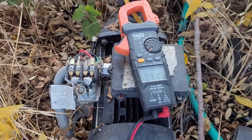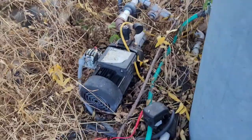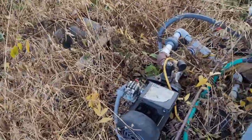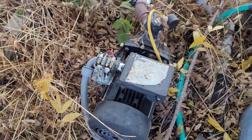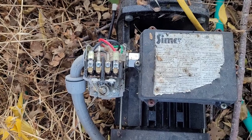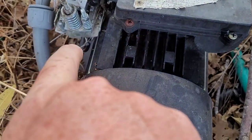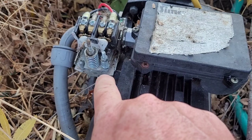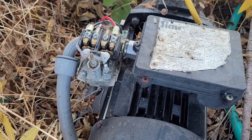That should get us down the road. Theoretically that should fire up now. Wait for it to build pressure — and that's what they're supposed to do, see how they're open now? Pressure has overcome the spring and opened it up. The big one is for actual cutoff pressure, and the small one is for where you want it to kick on. You gotta adjust those to get the pressure right, and if you don't know what you're doing, don't mess with them.